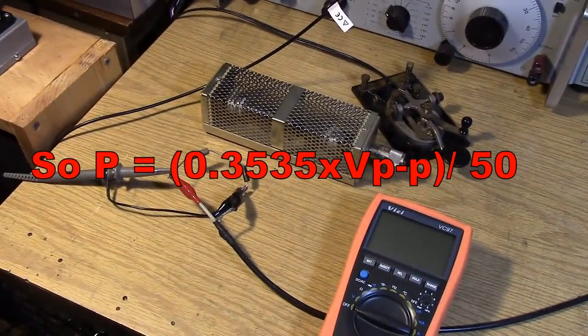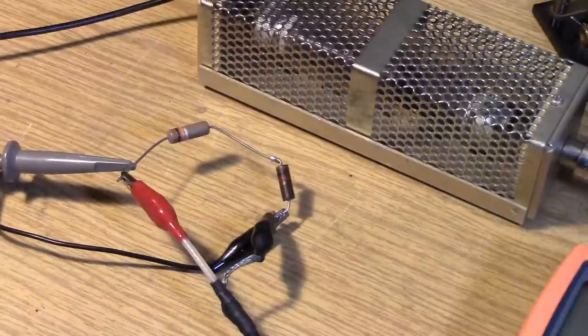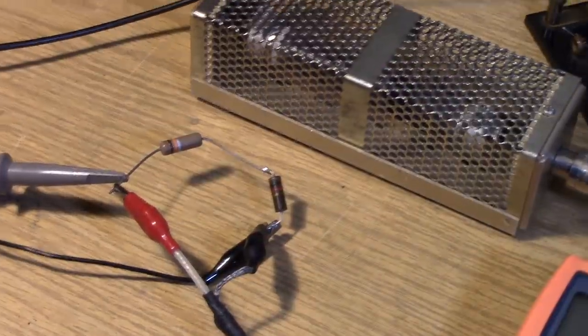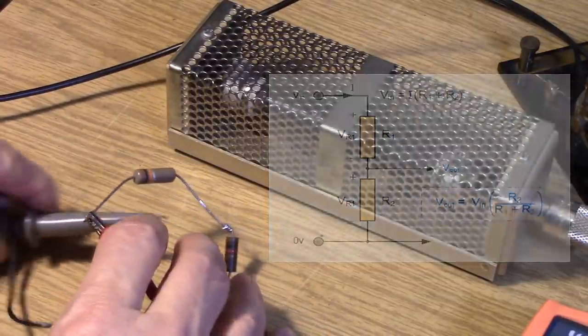The first thing was to design a little voltage divider. You might think: a 10K resistor and a 1K resistor gives a 10-to-1 divider, and certainly 10 or 11K isn't going to load down 50 ohms at 500 kilohertz. But someone pointed out I didn't do the math — the divider is actually less than 10-to-1. The lower resistor probably needs to be more like 1.2K to get a true 10-to-1. I did the math, and let's see what we're getting.